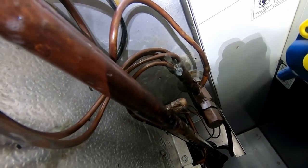That's not gonna be a lot of fun. Basically, it was leaking so badly that it was bouncing the noise ultrasonically off the aluminum panel on the side. That makes it very difficult to narrow it down even ultrasonically. And I had, at that point, probably 75 to 100 pounds of pressure on it. I had to take it all the way down to about 10 pounds of pressure before I was able to actually get it to bubble.